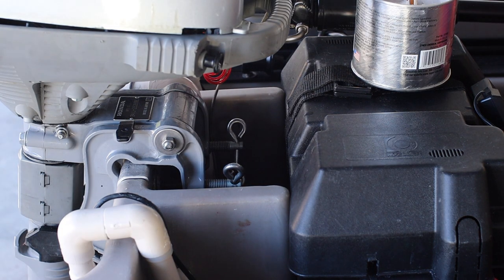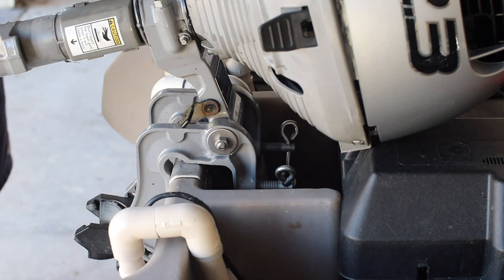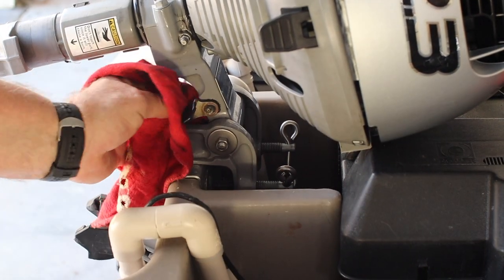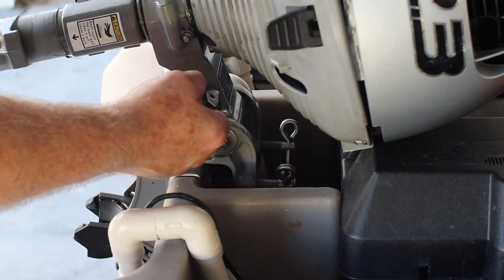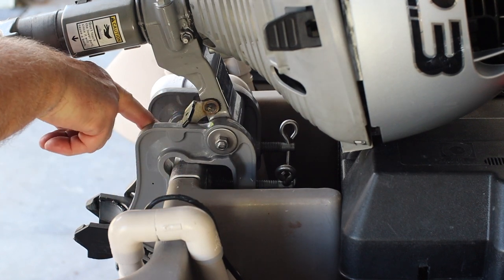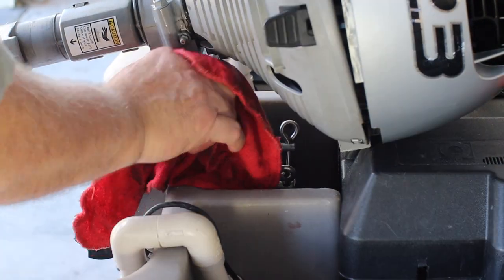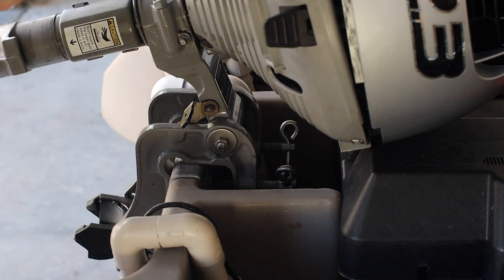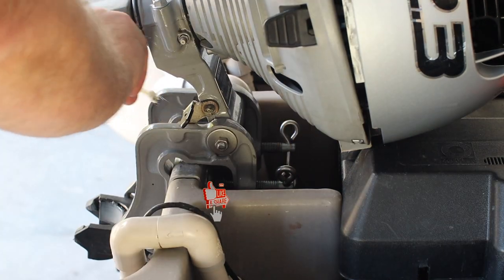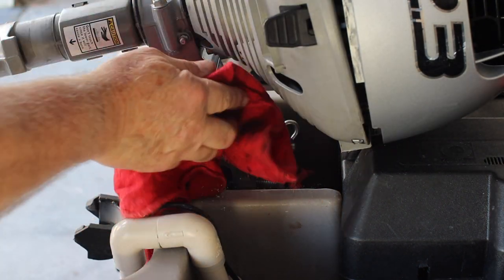I often stand back to look to make sure that I have the motor centered on this metal plate. I don't want the motor to be off-centered because then it tends to drive itself to one side or the other. Hopefully you can see this little lever that you flip when you want the motor to come back to the down position like you're going to drive it. All it is is a little piece of metal that gets wedged against a little spot in the back and that stops the motor from going down. You lift it up and then it will go all the way down. The only moving part here really is here — it's spring loaded. I take a Q-tip again and I'm trying to go around this so that when I work it back and forth it will get up underneath there — lubricate it and then wipe off the excess.